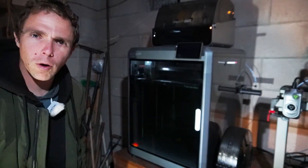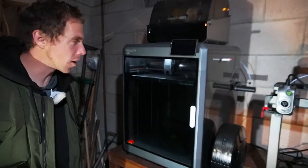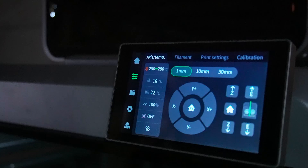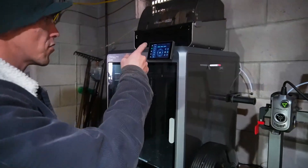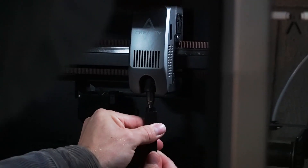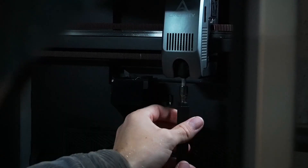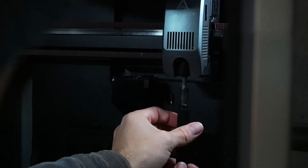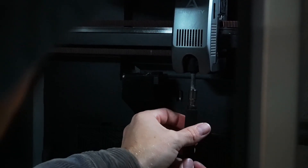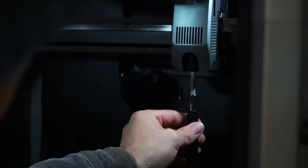It's about 2 in the morning and we are in the workshop checking on the K2 Plus. It's making some lines, so that's always a good sign. It's doing some zigzagging. Okay, so when using this PPA CF you've got to do a nozzle change. Set the nozzle head for 280 degrees Celsius. Going in there to take it off using the little socket, turn it to the left — rolling it out. Set it to 280 because that's the temperature for the filament we're using currently. Normally it would be around 220, but that's the nature of the game on this one.